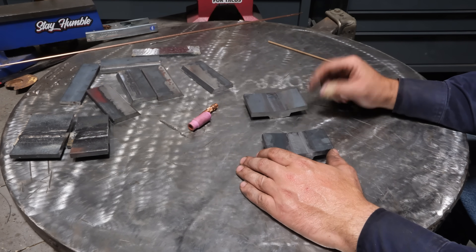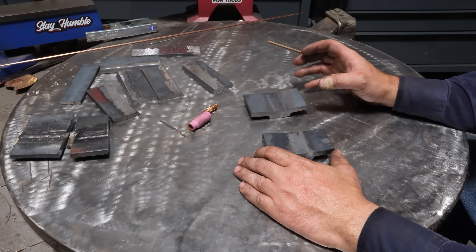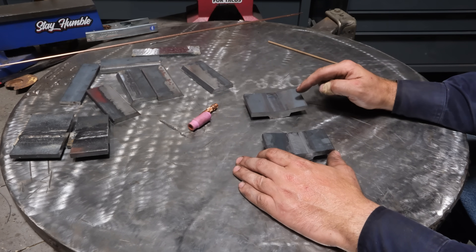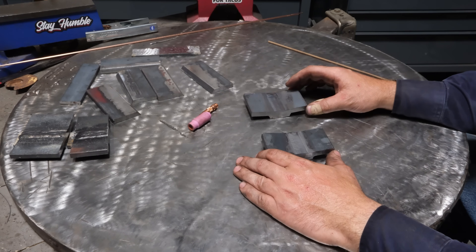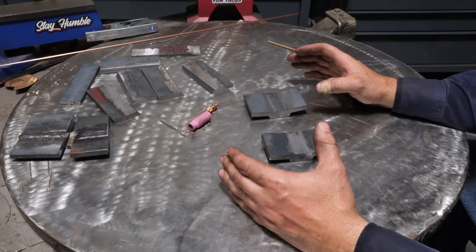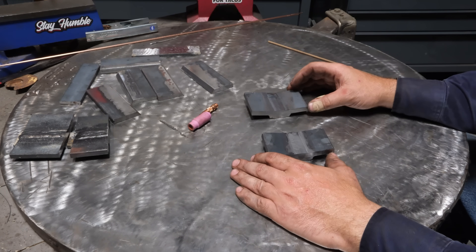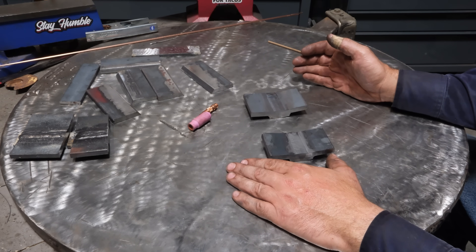Speaking of expense, a $300–$500 TIG welder — or even a stick welder with a scratch start setup, a simple $100 TIG torch and an argon bottle — could have achieved the same result. It's not that expensive to get into TIG welding on the front end, and you can get quality results with practice. This is not going to be super easy for an average person, but it doesn't really take that much practice to get decent results on thick plate. If you've got any comments, questions, or thoughts, feel free to leave them.